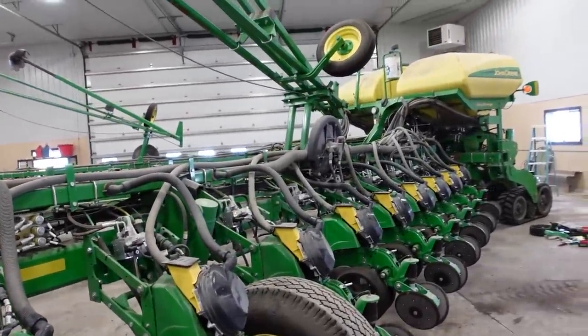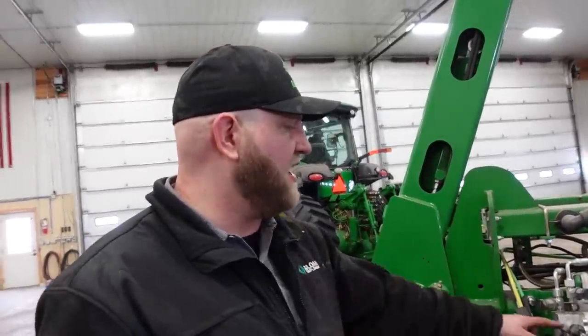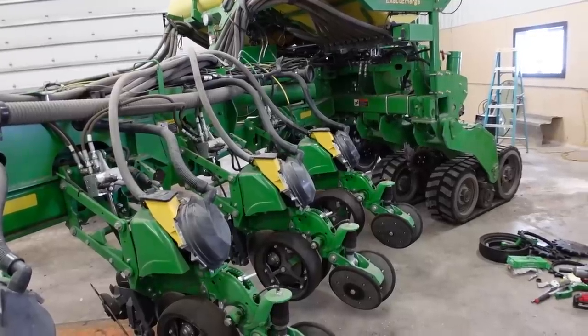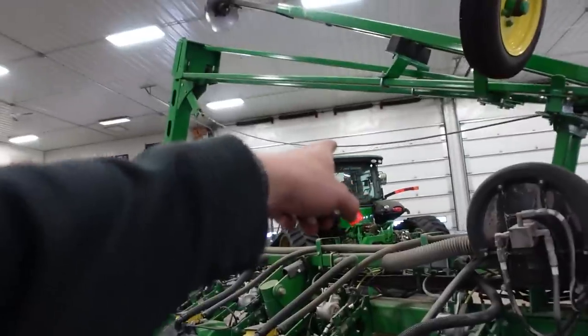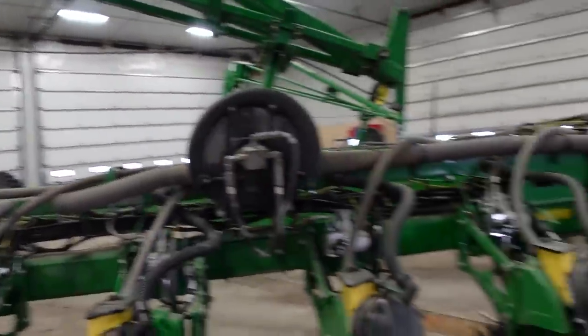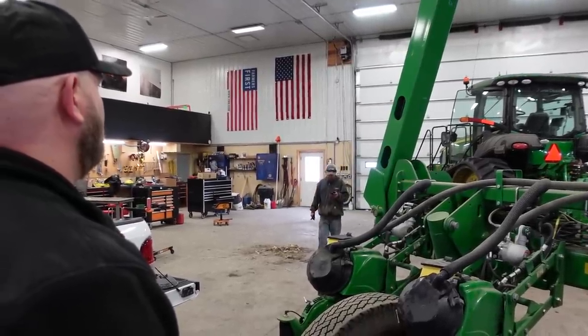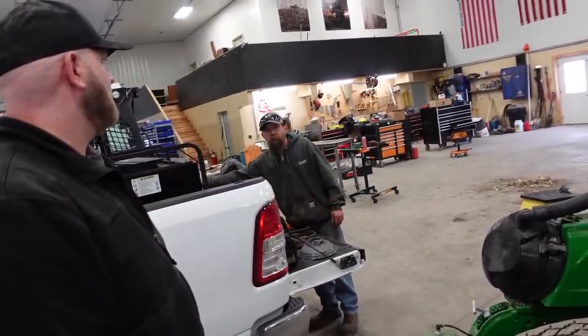Everything has been flushed out. We're going to run the accumulator charge test to see if each one will pass and make sure the actuators are working correctly with correct pressure at the sensor. Seth can see the red bars on the display — that means we've got some that are not passing, so it may be a sensor issue. Running them over and over because sometimes it'll bleed out. Rows 6, 9, 10, 11, 12, 18, 19, 23, 24 are failing — that's about half of them. Is that something where they could have all gone bad over winter? That's what happened on that last one.